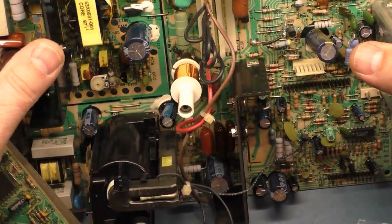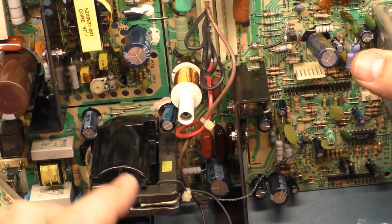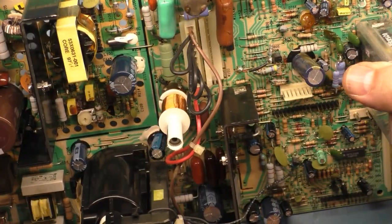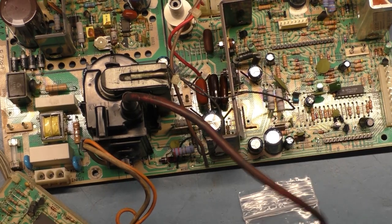What I'm going to do, before we power it up, I'm going to do all that previously mentioned stuff. And then tomorrow at this time, we're going to actually isolate W159 and do our light bulb test first. If that passes, given that R104 was bad, then we'll proceed with hooking it back up and then putting it on tube and testing it. So I'm going to cut away. When I come back, it'll be 24 hours.